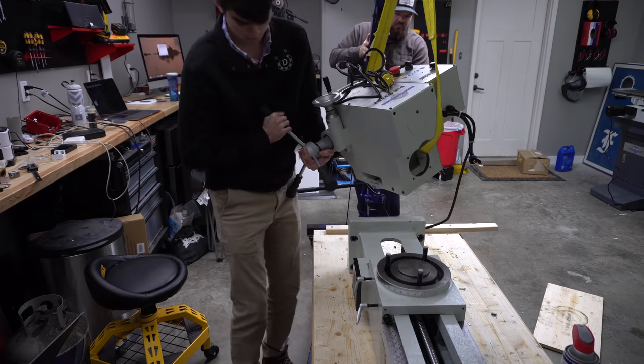There are 2 sensors located at the minima of the X and Y axes, as well as 1 sensor at the Z max. I used my custom 3D printer to fabricate the brackets that hold the sensors. These limit switches, while not completely necessary, will give my mill spatial awareness so that there is no potential for it to run into itself. Next, let's talk about both the computer and software that run this mill.